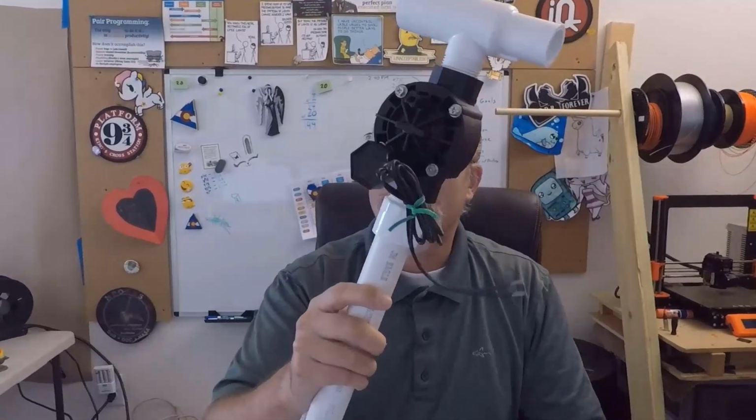So with that, just to go over what we're going to do, I'm going to dig down a little bit, put down some weed barrier, build up some rock base underneath the sprinkler valve system, clean up some of the piping, and then install 3 new valves. Here I've already ordered a bunch of valves, so I got these to install. And then put down some new sprinkler boxes, the boxes that cover the sprinklers when you're all done. So that's the basis of what I'm going to do today.